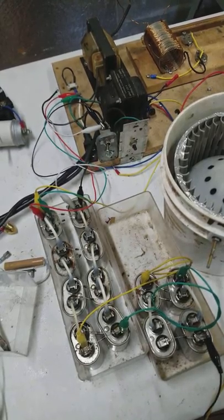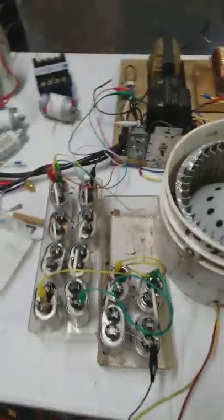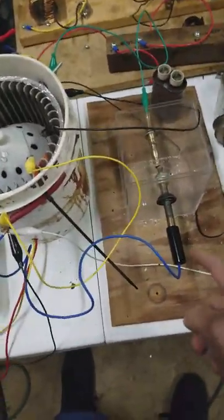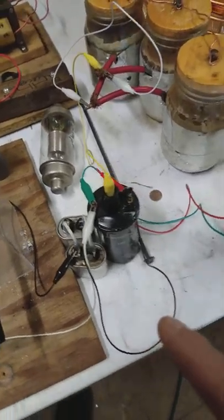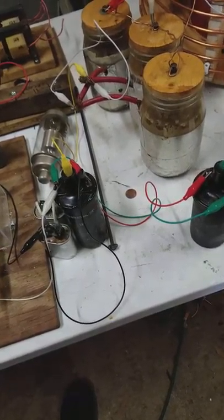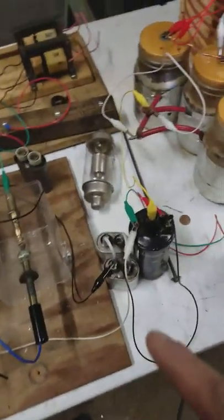This is a standard deal with three stages more or less. I get about 350 volts DC output from it. It's not hooked up well — it's in parallel — but I'm just basically running a spark gap here with a little capacitor, 10 microfarads in series, and two induction coils coming off directly in parallel, so the spark gap is actually shorting the two coils.